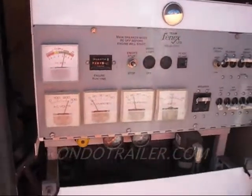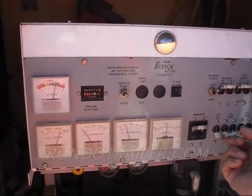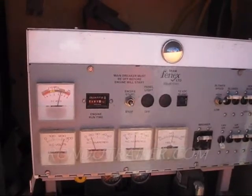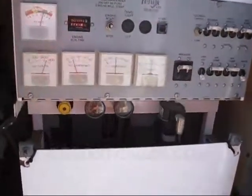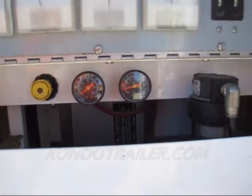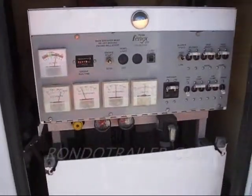Now we're going to really make it work — the air compressors. It's got two air compressors and then an air dryer. Let's fire up the air compressors. Another air compressor. And then the air dryer. You can hear the air starting to work — look how fast that comes up. It's coming up to 20 psi already, and it had zero in it. So it's just sitting there humming. We're pulling over 50 amps.